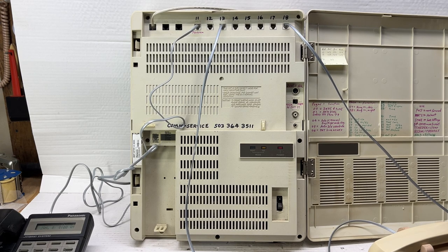This will allow rotary dial telephones and touchtone telephones. If you're using a rotary dial phone and you dial 9 or the trunk codes 81 through 86, the PBX will take the rotary pulses and turn them into DTMF and send it to the telco line as a tone instead of a rotary dial.